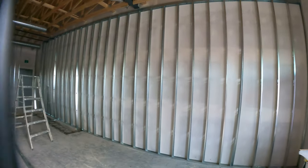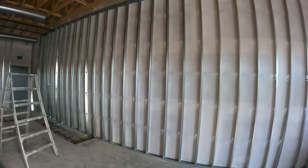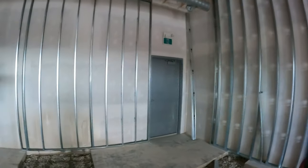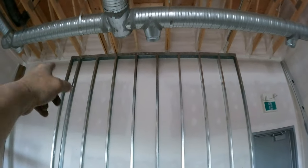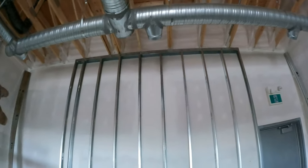Progress — all my tops are screwed in. I'll screw off all my bottoms at the end. The furring walls are complete on the back and the side. It was a pain without the concrete on the baker. For this wall I just screwed the track to the joists — laser up the end, double-check, then pre-screwed the whole length of the top together and screwed the studs in.